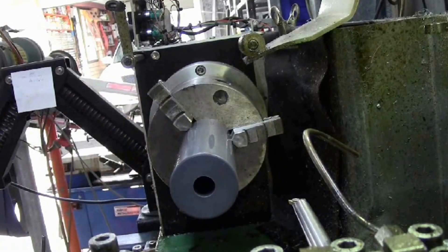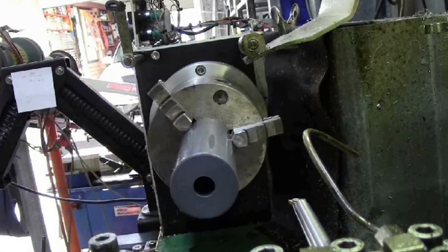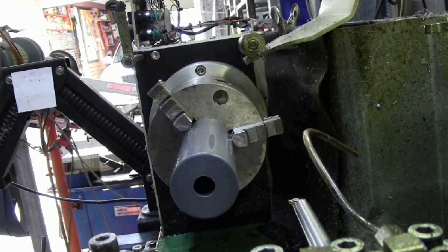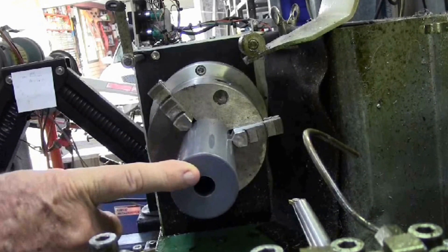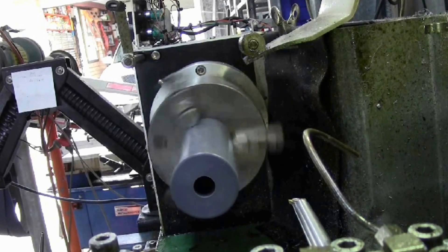Just loading up the blank material. It sticks out about six inches from the face of the chuck, so I have to take very light cuts — half millimetre cuts — in this PVC plastic. First thing I do is run it up and just eyeball it to see if it's running reasonably true. If not, I'll take it out and put it back in until I get it running true.